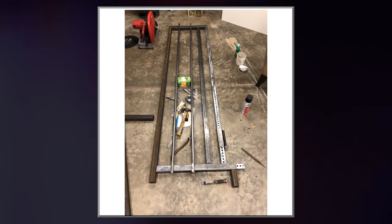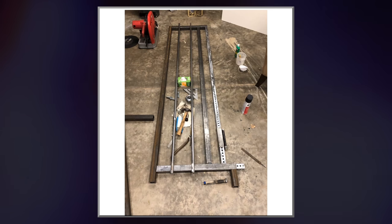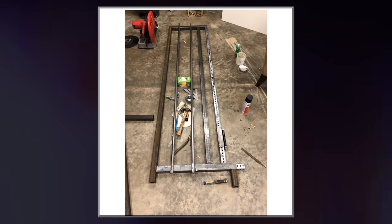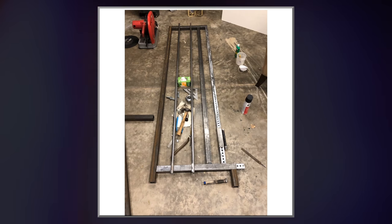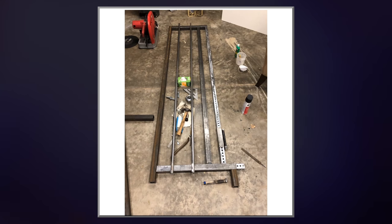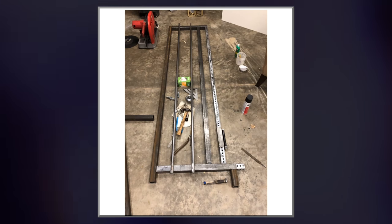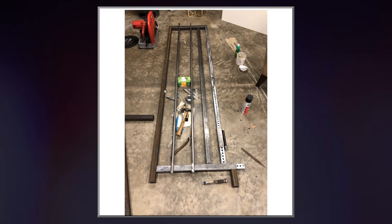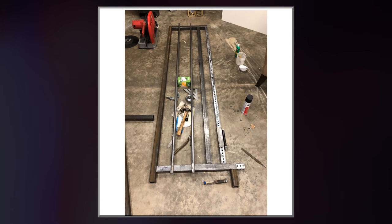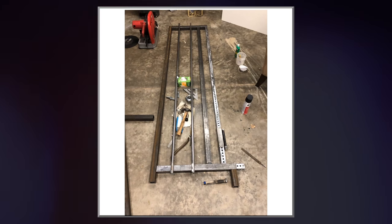These right here are the guide rods in place. They're not cut to length yet. These guide rods are 1 inch in diameter because the weight stack that I bought calls for guide rods that have 1 inch diameters. It just depends on what weight stack you buy, if you're gonna use a weight stack or if you're gonna construct a little device that holds weight plates. The diameter of these guide rods doesn't necessarily matter, and you don't necessarily have to use two rods. You could use one piece of square tubing that goes the whole length. It's up to you, really.